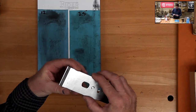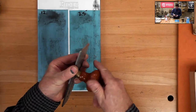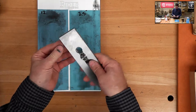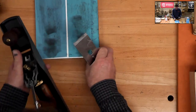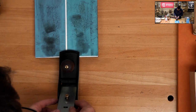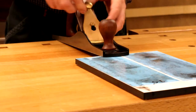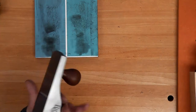board. Okay, just going to tighten this blade back up, set the plane up. We're back about a millimeter off the front with the chip breaker. Turn it over, we've got our blade. Plane wise, just going to slide the board forward because I can sit the front of the plane on there so it's not resting on the bench. Level things out. Chip breaker on the top and the cap iron goes on. Gently tighten up. Not too much weight behind that at the moment.